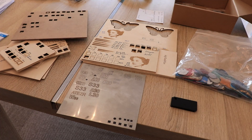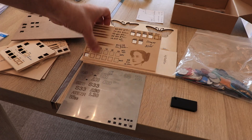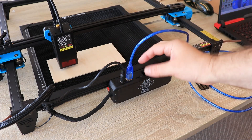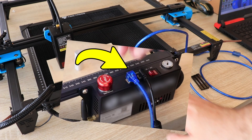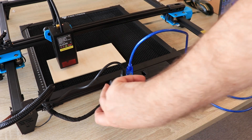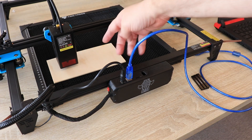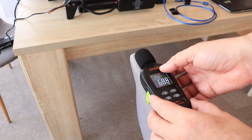These are the materials I regularly use in these videos so results are comparable: stainless steel, anodized aluminum, black acrylic, and different types of wood. At the end I'll have a summary card for this engraver. I really dislike when the wires stick up on the upper side — it would be better if they were on the side or at a 90-degree angle. There's a slot for an SD card if you use the app, and a connection for the display which can probably be purchased separately. The machine is not super quiet but not too loud, and the fans appear to always be on — it would be better if they only ran when the module is working. The noise from approximately half a meter distance is 60.5 dB.